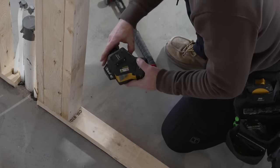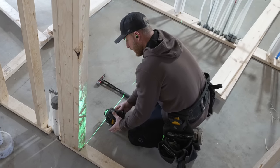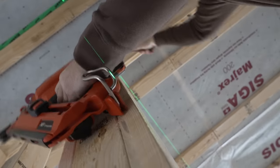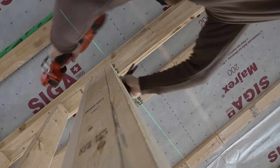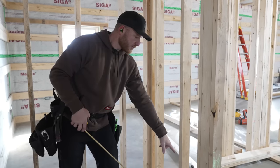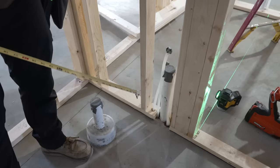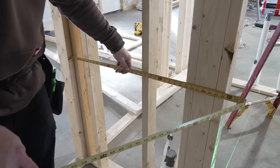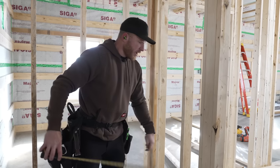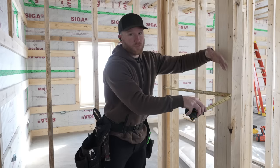I'm being very particular in showers — making sure everything is as plumb as possible. It makes everybody's job way easier later on. Where all your additional blocking is needed for things coming after framing, like showers: you always want a nice solid frame on the edge of your shower so the shower can attach and your drywall can also attach there. With a 32-inch shower, I've got solid framing and a nice plumb strong door jam. Always frame plumb, but it's especially important around showers and anywhere you know cabinetry is going.